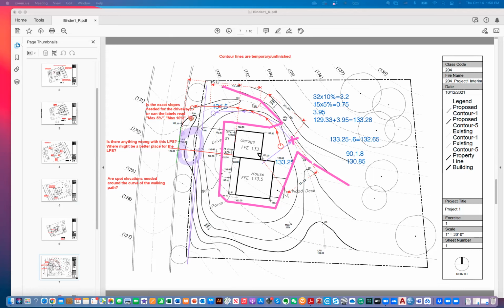All right, so under slope parameters, it says maximum 5% slope for the first 15 feet away from the front of the building and added door. All right, so you're right about the front. Yeah. I just thought it was around the whole thing. Yeah, it's the front, and okay. Then the door here. Right, the door here, by creating this flat space here at 2%, you're automatically meeting that 5% slope rule.